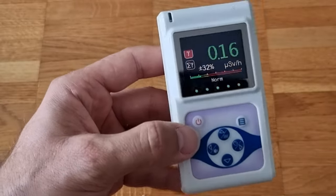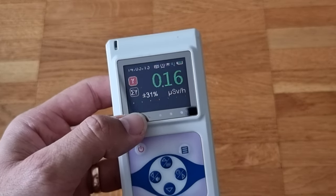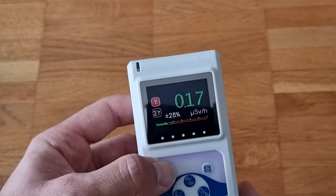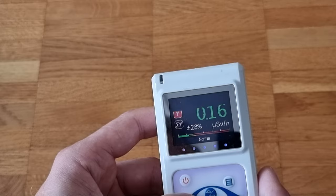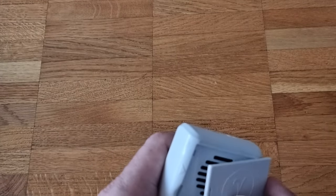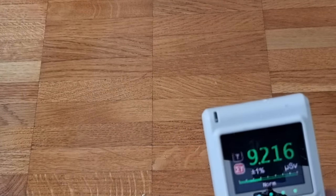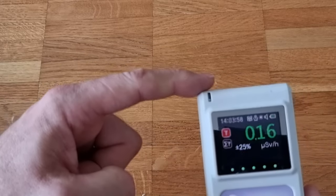So what we've got here on the device — it's an OLED screen, but because of the 60 Hz refresh of my video screen, you can see the actual refresh on the screen. When you're looking at it with your eyes, you don't see that. Sorry for the sort of progressive scan there. If you put this on gamma, we will need to have our cobalt-60 source, and I'm going to put this on to gamma detection by putting this over here. Cobalt-60 is also a beta source, so we just want to discriminate for the gamma. We're going to sum the gamma here, and I'll bring the cobalt-60 source into view — you'll probably see it start to go up — and we'll just bring this down closer to it.